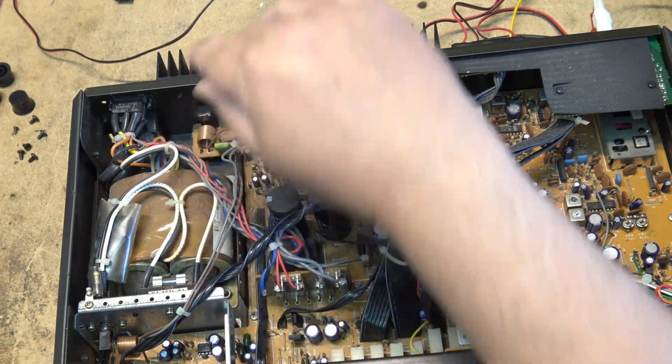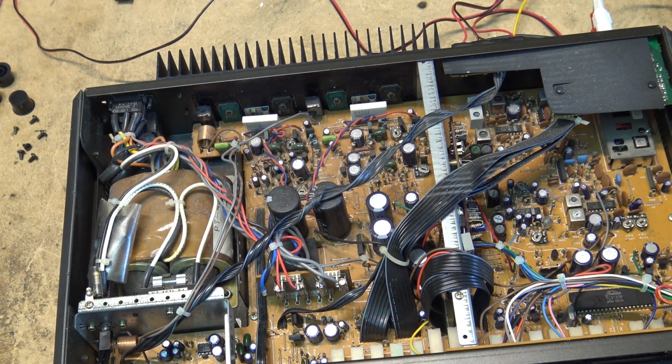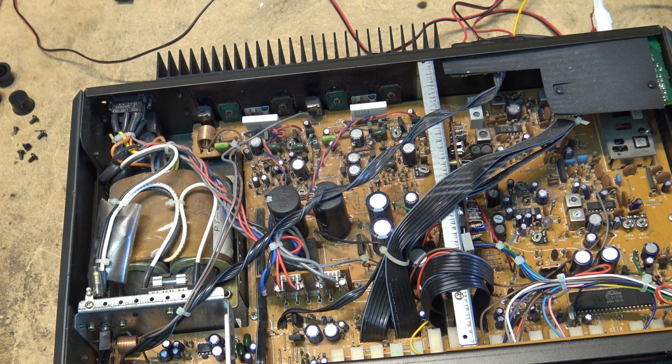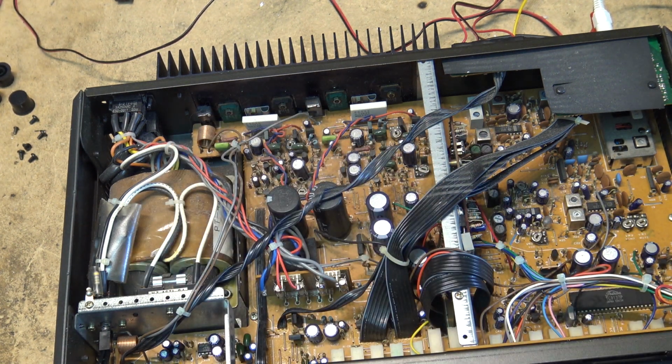And you'll never blow these transistors, as these transistors are rated at 100 watts. So the power supply is never going to provide enough power to even damage these transistors. If you short the speaker terminals on this, it's going to trip the circuit breakers, but it shouldn't blow the outputs because it doesn't have enough power. And it's also fully fused. Look at all the fuses in this thing. There's 4 fuses here, and there's another main power fuse over here.